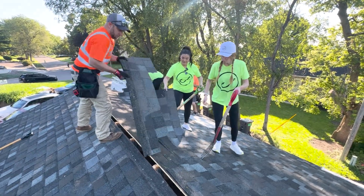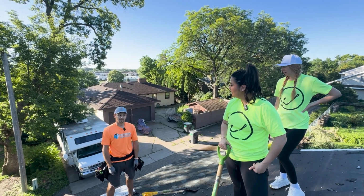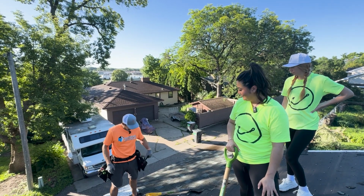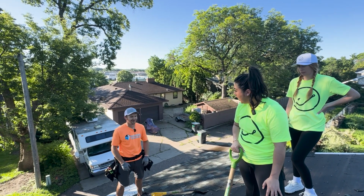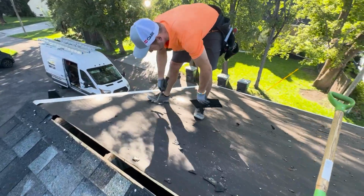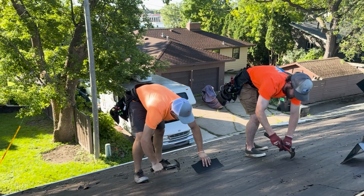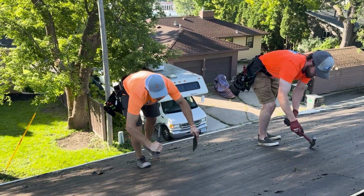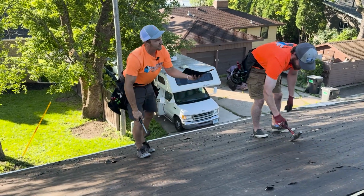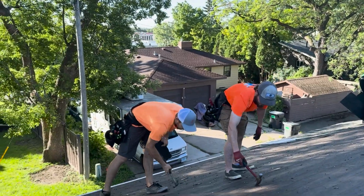Teamwork. Oh, you denail. I was gonna say, what happens to all these nails? Obviously you gotta take them out. Pull them out with just my fingers? Yes. With a pair of pliers. No, one by one. Why are you hitting it to get them to kind of fly up? Because if you hit between the studs, it bounces the plywood and helps sweep them down. I usually have a piece of shingle I use as a sweep as I go down, so you don't gotta blow off the roof when you're all done.